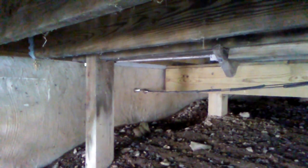The ladder line continues over to the block wall, going out through two pieces of half-inch PVC water pipe that I have cemented into that block — two holes that penetrate the block to the outside. Here's the other side of that block wall under the deck. The ladder line continues all the way over to a junction where I have a piece of PVC conduit where the ladder line terminates into two banana jacks.